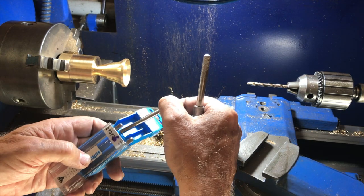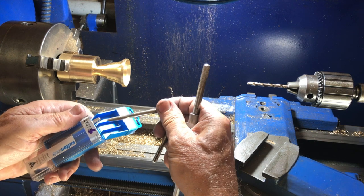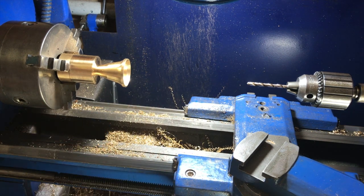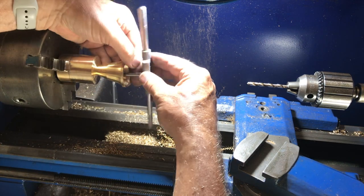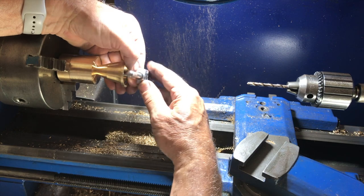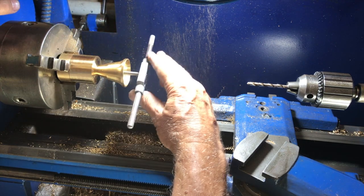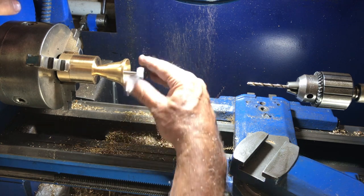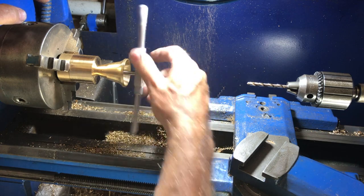Previously, I broke my 6mm tap and had to go and buy a new set. Now, these ones came with a starter tap, which is tapered, or a taper tap, an intermediate tap, and a blind tap, or third tap. And in this case, I've got a hole that's almost blind, and I'm using this sequence of taps so that I can tap all the way to the bottom of the hole. The last tap is not tapered so that it can thread all the way.